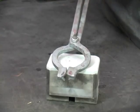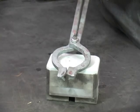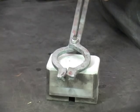We will do this hot. When we have it right, we'll remove the bolt and nut and replace it with the rivet, set the rivet, make one more quick adjustment for anything that went wrong during the riveting, a heat to loosen the rivet, and we're done.